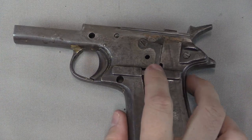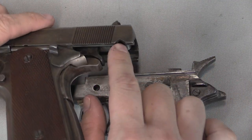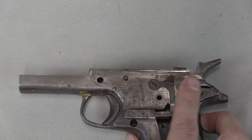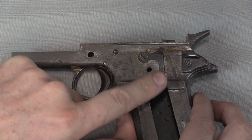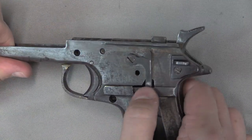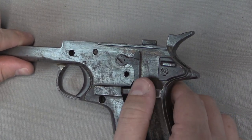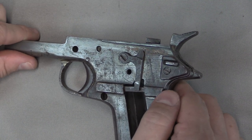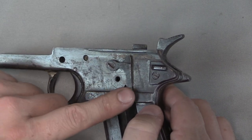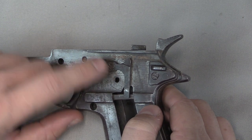What's also interesting is you don't actually have this system on the 1911. If we look at the bottom of a 1911 slide, there is a cutout, but that's for the manual safety — there is no safety cutout like this. The reason is the 1911 didn't use this, but all of the Spanish Eibar pistols did. This was a very typical system on blowback .32s. So clearly whoever was building this gun also had access, experience, or some sort of understanding of Spanish pistol design. But despite knowing what it was there and knowing to add it, they didn't know how to actually make it do what it's supposed to do.